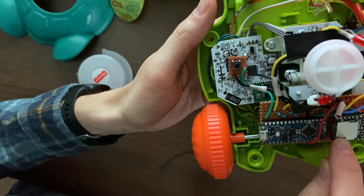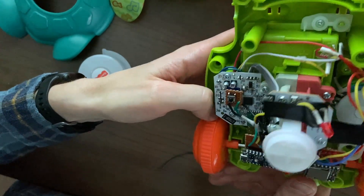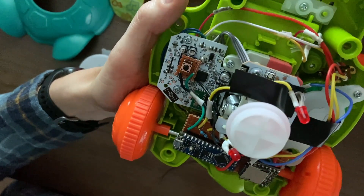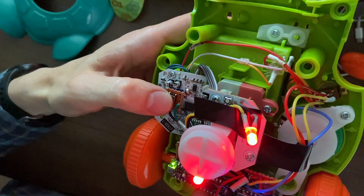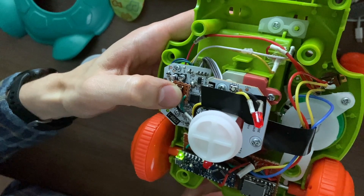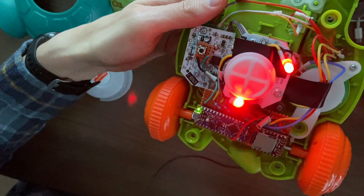The DFPlayer Mini takes a little micro SD card — that's how I loaded my audio tracks onto it; you just slide it into the micro SD card slot on top of the chip. It was a challenging project. There was some noise, especially when I was using the 9-volt battery. Switching to the 4.5-volt 3-AA source really cut down on a ton of noise, but there's still some. When you heard me play the track you probably heard a little of that noise — some tracks have stuttering in the audio. Other people talk about using capacitors for that; I didn't want to get into it.